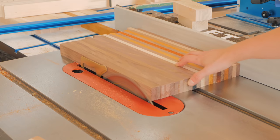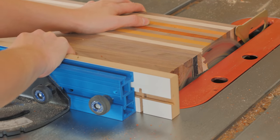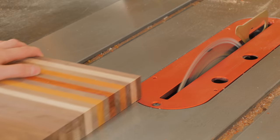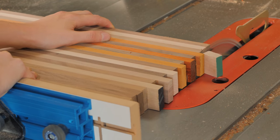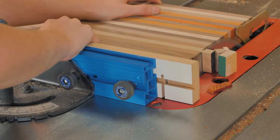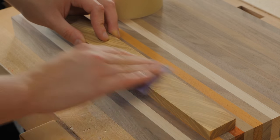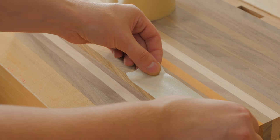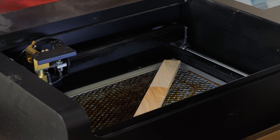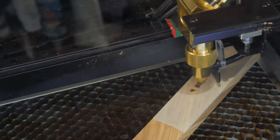It's time to make the final trimming and bring the boards to their final size. There is still the olive wood piece that I put aside before the glue-up, and that is because I wanted to make a little engraving. So I set up my laser machine and placed the piece diagonally since it didn't fit horizontally on the small bed. I made the engraving off-center towards the top because the cutting boards will receive a chamfer on the bottom edges.